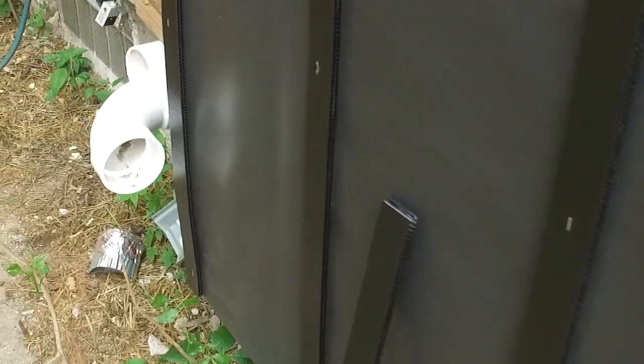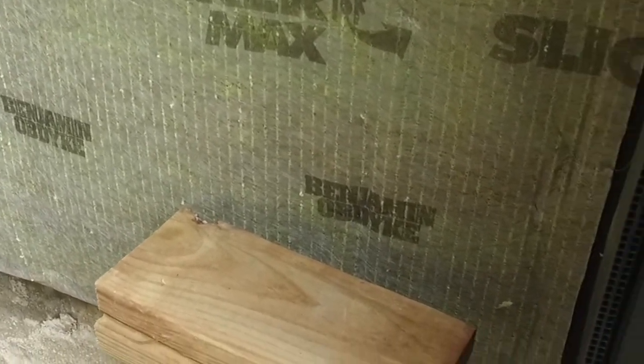You'll notice the batten has all of these holes in it, and that allows air to pass horizontally through the system as well as vertically. One of the problems with wood furring strips is that they're solid. If you've got a solid block and you run up to something like the bottom of a window, the air is trapped between cavities. If you forget to leave a gap, air can't get out. On an open joint cladding system that's less of an issue, but with lap siding and no home slicker, your furring strips would create that condition.